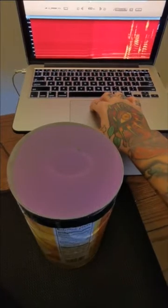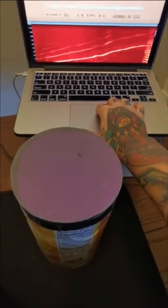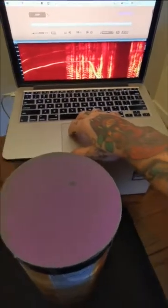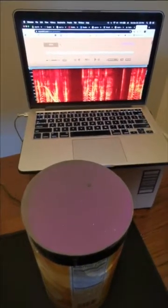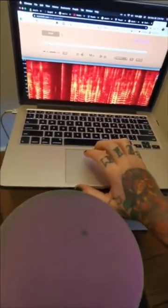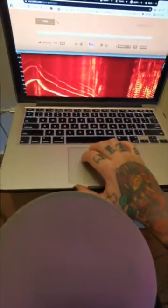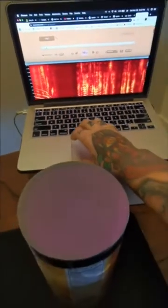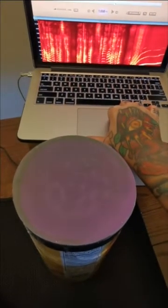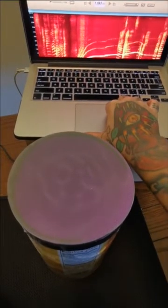417 Hz for the second mode. And we're back to the problem that the amplitude is not high enough. The reason this is happening is because if the amplitude isn't high enough for those high frequencies, the displacements are a lot smaller at high frequencies, so the mode shapes just won't pop up. Let's go to 100% volume — there were a couple up there I wanted to see again. Sweeping through the lows really quick. There are those higher modes — look how pretty. About 1090 Hz.